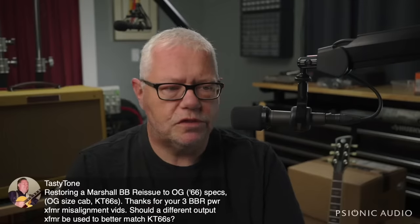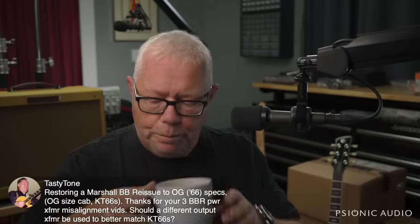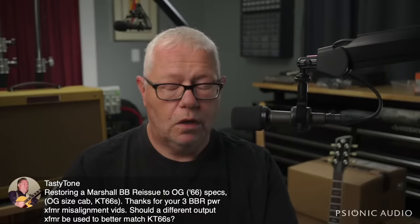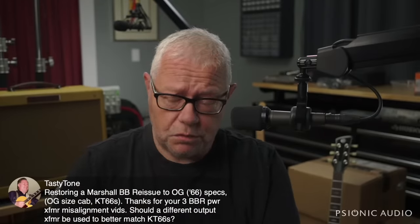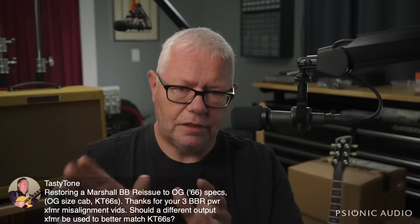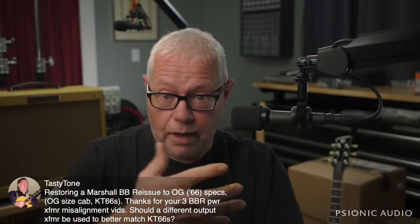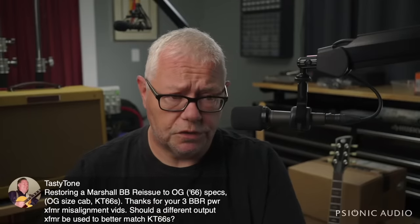First question of the stream. He's restoring a Marshall Bluesbreaker reissue to OG 66 specs. And he likes the videos where I show how the stock one's got the power transformer, or its output transformer, depending on how you look at it, polarity reverse, orientation reverse. So there's a big noise field that emanates from the power transformer. And if the output transformer is not at a 90-degree angle to that, so the one wind's going this way, the other wind's going this way, it'll pick up that field even in standby, but certainly while you're playing it, it just jumps into the entire audio circuit.